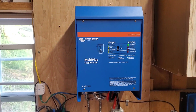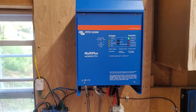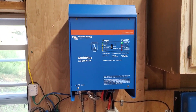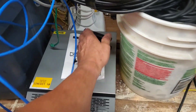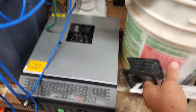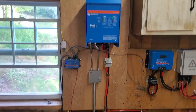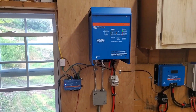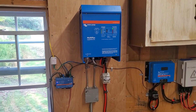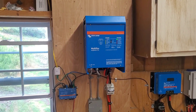This unit has a five-year warranty and it's really nice — been working good so far. It runs my air conditioner without swapping back over to utility. I took my V-Vor out of there — that was working fine, except it's not a transformer-based inverter, so when my air conditioner was coming on downstairs it was swapping back to utility for about 10 minutes, then it would swap back. That was annoying, but this doesn't do it because it weighs like 60 pounds — it's got the big transformer in it.